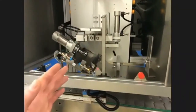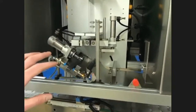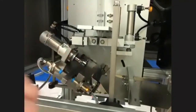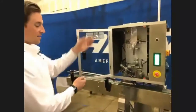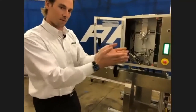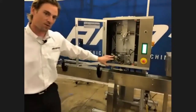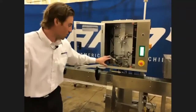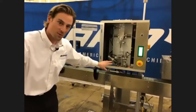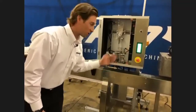As we come through here, there are some drives that keep this consistent and maintain tension. Where the magic happens is the guillotine cutter. Traditionally with our LX series, you'd see six blades spinning and cutting the band — that's not what's happening here. Here, the guillotine cutting feature has the blade lopping off the film as it comes down. Once that blade cuts the next band, it suspends it at a 45-degree angle. With the LX series we're hitting a moving target, but here we're just thanking Isaac Newton and gravity — the container grabs the band, it drops down, puts it in perfect position, and we're off and running.